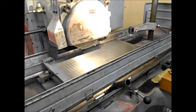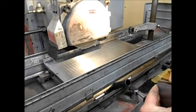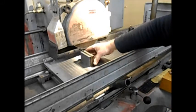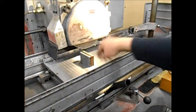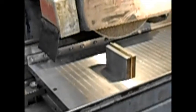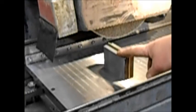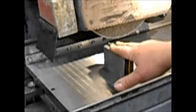With a mag block, if you sandwich a layer of something non-magnetic — normally brass, mainly because brass is easily soldered; you can make them with aluminium but you can't use normal lead-based solder — so that our brass plate sits on the aluminium spacer in the chuck, we'll have a north and a south on the blocks. We can then sit something on top of that and it will short out the north and south poles and be clamped down.